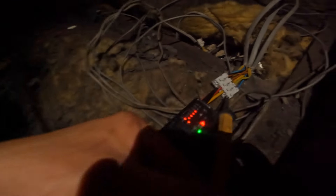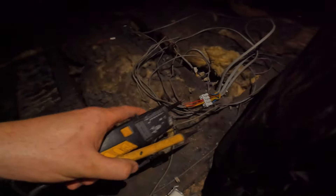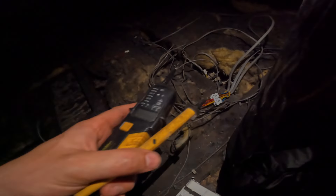That is definitely the wall so let's get that drilled. There's a bit of light down there - we'll send a cable down next. Then we need to pick up the nearest feed which is most likely that junction box there - it's a bit dodgy with singles hanging out so we'll have to redo it. We've got a permanent there - a permanent live - so we can nick that, redo the joint, run the cable down the wall and connect into the mirror.